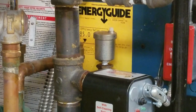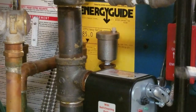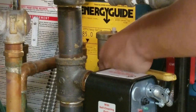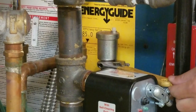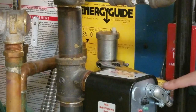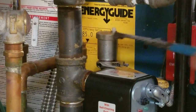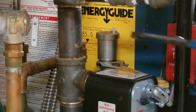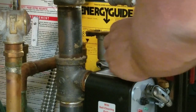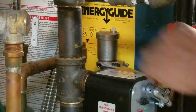If you want, you can put a wrench on the bottom. What you do is find a place like this, open it up, tighten it — now it's going to hit here. So what you want to do is utilize this leverage and just snug it, because now it's on the base of the boiler.